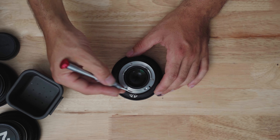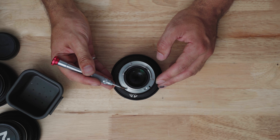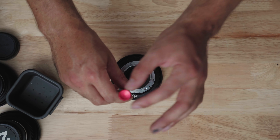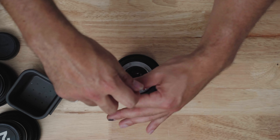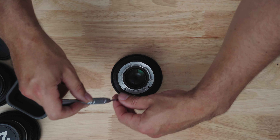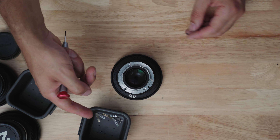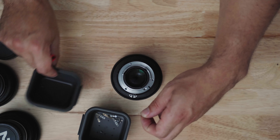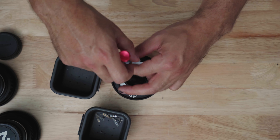The first thing I'm going to do is take off the Nikon bayonet adapter. There are three screws here. Generally these screws have some sort of thread lock or glue on them, so you have to be careful not to strip them. What people recommend is heating with a soldering iron for a few seconds, as well as placing the screwdriver on and lightly tapping it with a hammer or mallet. I just apply even pressure and unscrew. I also like to have a parts bin for screws from the original lens and a separate one for screws I'll be adding.